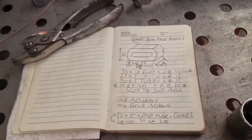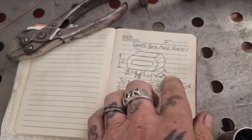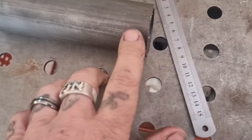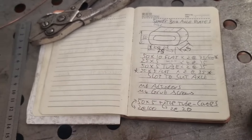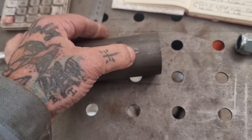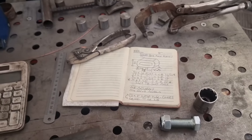We've found a sketch of these pillbox axle plate type things, and I'm going to make them a little bit wider for the purposes of this — I'm going to go 50mm, so 5mm wider. They consist of a bit of 10mm plate with some bits of tube modified, and you'll see as it goes. First thing we need to do is cut the material. We need a couple of pieces of this, 45mm long, and a couple of pieces of 50 by 10mm flat, 75mm long. Let's get them cut up.